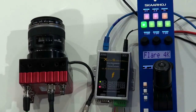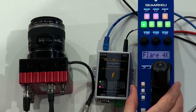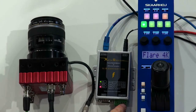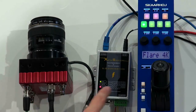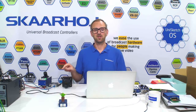What is the box in the middle, you may ask? The industrial camera is controlled over RS-485, and this controller, the RCP Mini, is Ethernet-based. So we need a translator. This RCP Mini talks through this Ethernet to RS-485 output converter — it just sits in the middle, has an IP address that mediates the serial signal to the camera. That actually gives you a lot of flexibility, because instead of running serial cables into your control facility, you can use network all the way out to the camera, because there's this converter in between.